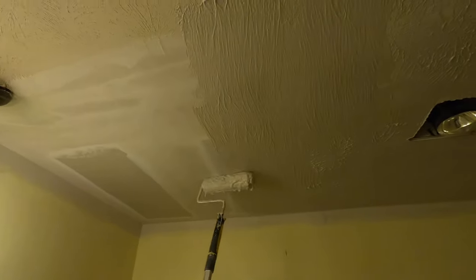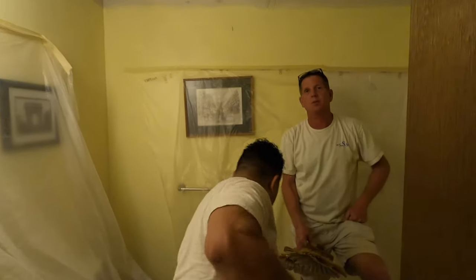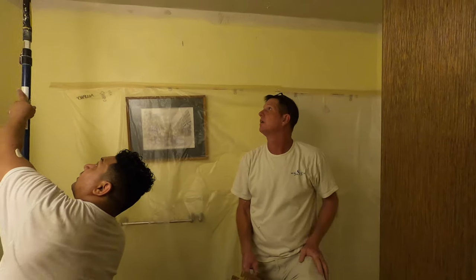Then you can move the brush — always keep moving when you stomp it. It's a good plop: you don't want to hit the ceiling real hard, but enough to pop the bristles up. Make sure you get the edges real good — the brush will cover it. You want to get those edges real good on the outside where your old rock and your new rock is. Make sure you do a good blend and you don't leave a line when it's painted.